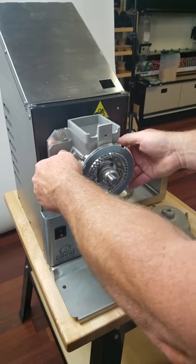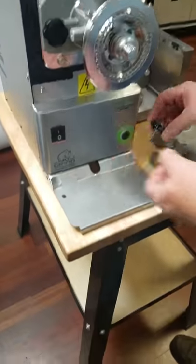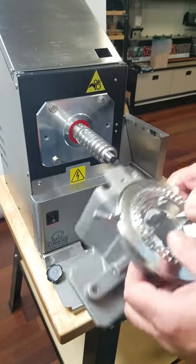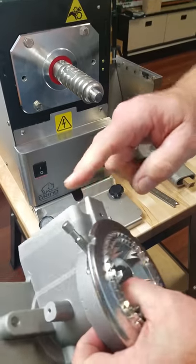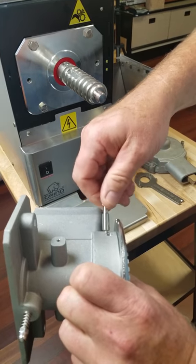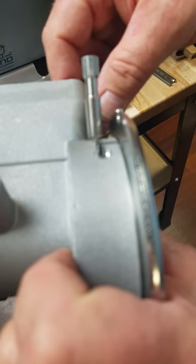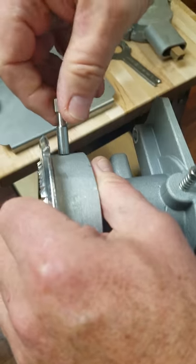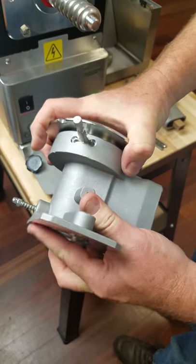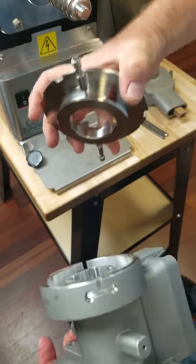The next thing we want to do is take off the main housing. You pull these thumb screws out — there are holes right here to rest them in so they're not lost. You can take this housing off. Now, to get the rear grinding plate off, you have a thumb screw here and a thumb screw here. You can simply back them out — take them all the way out or back the shoulder out enough where it clears the aluminum casting. Same on the other side. Then you simply rotate it, line it up, and it comes out.